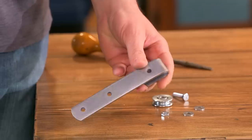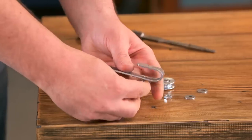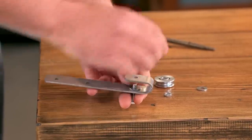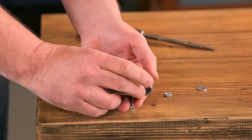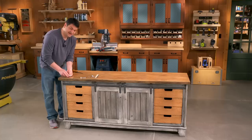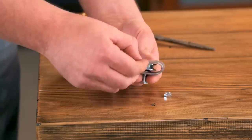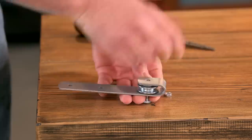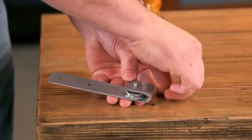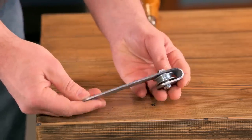Now with the hook formed and the holes drilled, we're ready to assemble. It just starts with the hex bolt here. We'll thread that in through the front. Then we'll add a washer. Next, the pulley. I'm just using the bolt to kind of catch everything here. It's a lot easier to assemble this with nobody watching. So we'll add the last washer. That in there. Use a screwdriver to kind of get it centered. Pop the bolt through. I'm going to add the jam nut on the back to hold everything in place. And we have the roller hook complete.